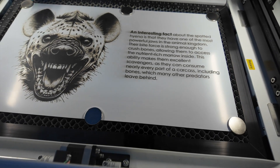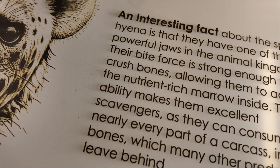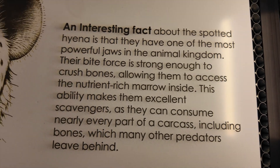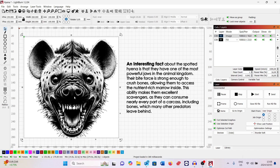The text engraving was at 3.6 — you can see there's not much dust around, which is great for engraving especially on two-color plastic when you don't want to mix the colors. White on black and black on white — that was really good. Not much dust there even with that kind of setting. So this was the file design — I got this image off ChatGPT, prompted it to give me a hyena looking right at me, got the image and then converted it to 300 DPI BMP — bitmap — and imported it into LightBurn.